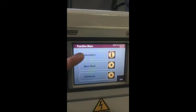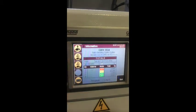Now we make our way to the function menu. The Information section contains the name and version of the blender, and also shows the batch and material consumption per component. The throughput per hour is calculated after each batch, specifically after running for an hour's worth of batches.